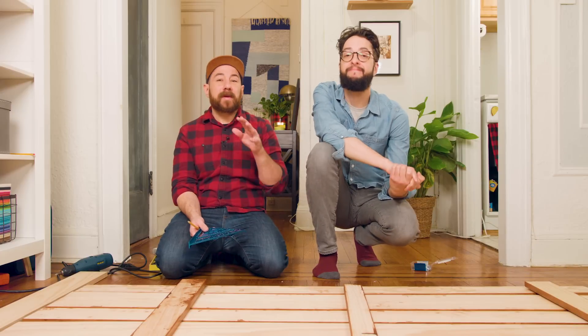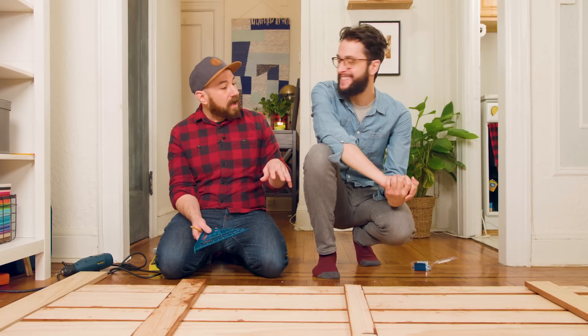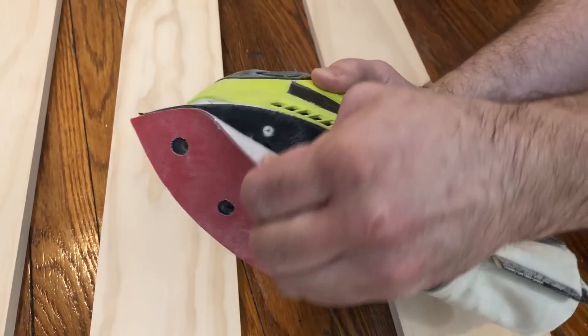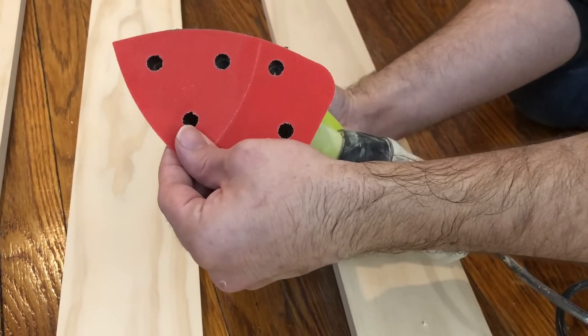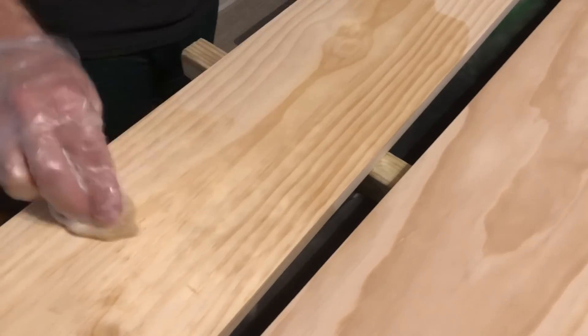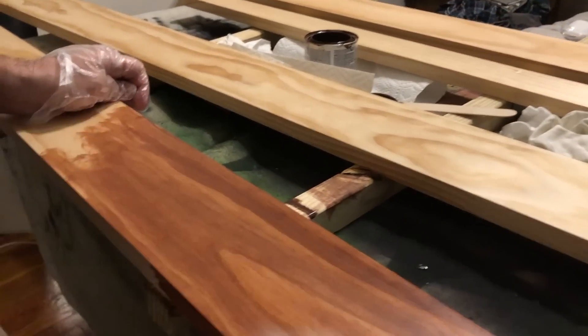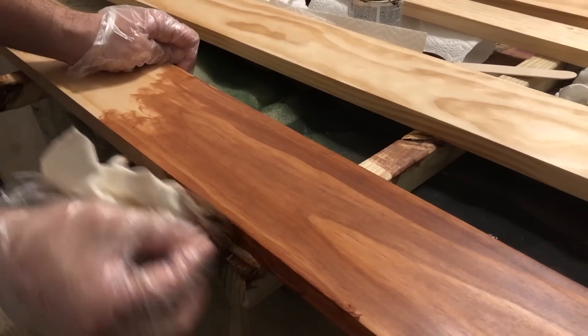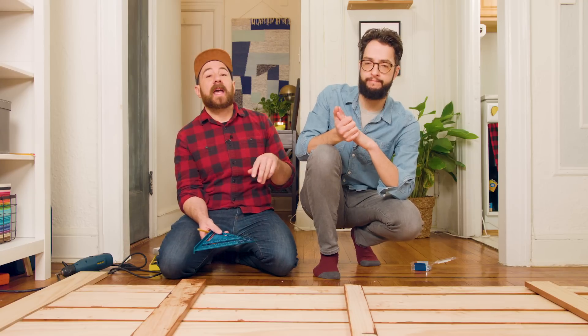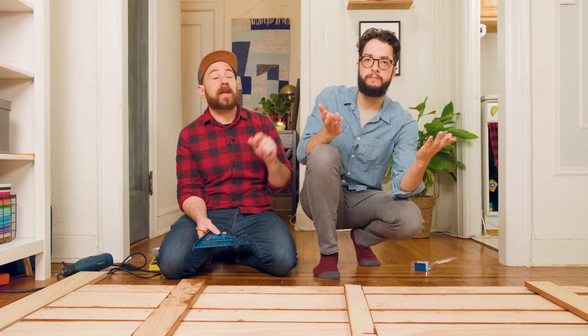We have all our wood ready to be assembled. It was kind of a lengthy process because we're using pine — they recommend sanding it for days. We started with a 150 grit sandpaper, then moved on to a 220 grit sandpaper. Then we did a pre-stain, just so the stain is more even because pine is a really soft wood. Once that was dry, we stained our wood. Then we polyurethaned our wood, let that dry, gave it another quick sand down with a 220 grit, and then re-polyurethaned for the last time and let that dry. We recommend doing it in a well-ventilated area — not a one-bedroom apartment like we have. Better yet, if you can take it outside, do it.